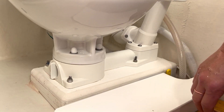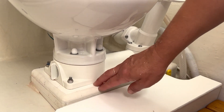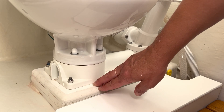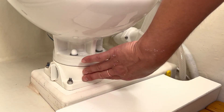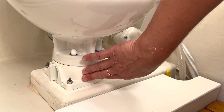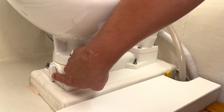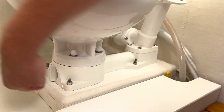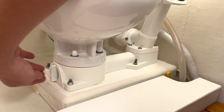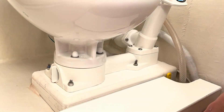When installing the toilet into the boat, we found it easier to install the base of the toilet onto a PVC block of lumber — with stainless steel screws — and then install that PVC block onto the deck of the boat. It corrected for a little height discrepancy; we had enough folks tell us the toilet felt a little low, so we were able to add a couple of inches to the actual seat height. It also helps keep clearance to access the plug at the base of the toilet for easy draining, maintenance, and winterization.